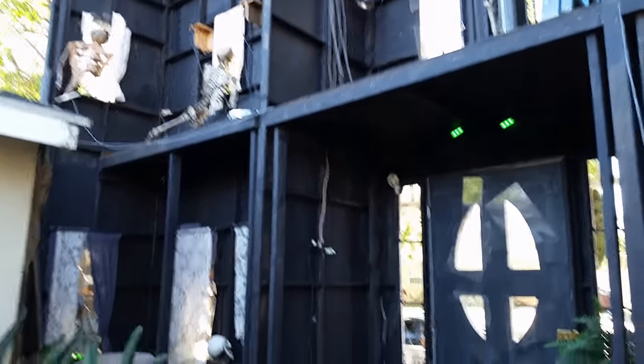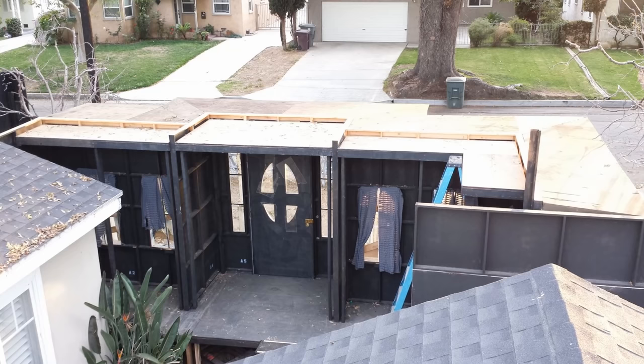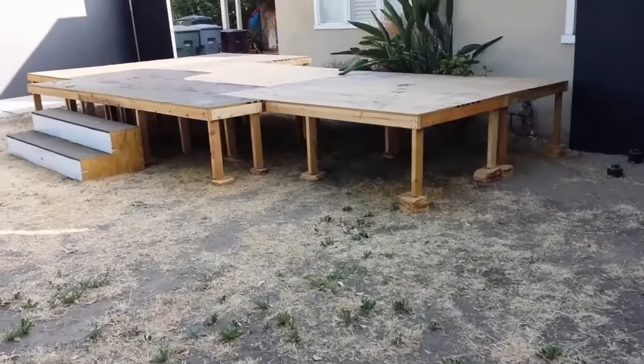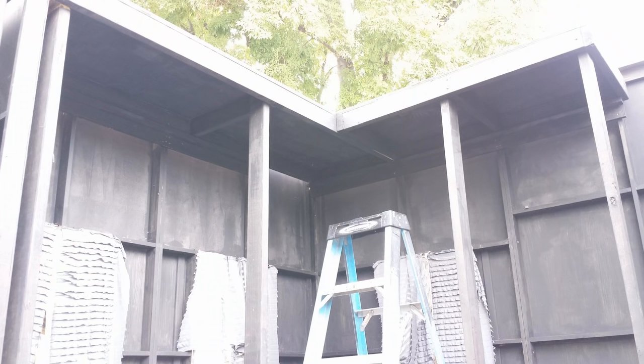The center walls along with the front porch covering and the second story decks all helped stabilize the entire structure. All the lower walls were screwed down to the bottom decks, and both levels of decking were constructed with three-quarter-inch plywood and two-by-four framing. It was plenty strong to support us up on the ladders.